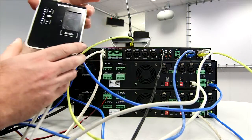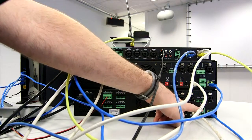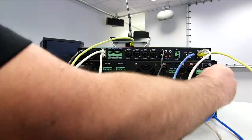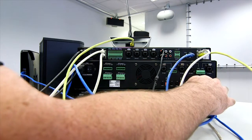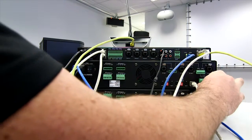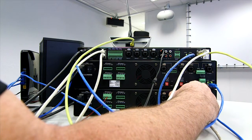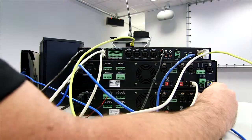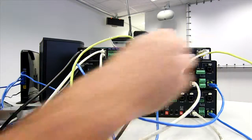The one thing I'll add is that the rear of the unit for the sensor for the auto standby mode is down at the bottom of the amplifiers. There is a 12-volt supply for movement sensors, and also a contact closure that can be accessed. The override input is below that, so you could actually put an EVAC or emergency override signal to the amplifier, or use it to pause the amplifier while the EVAC system is taking over. This is not an EVAC product — it's not EN54 certified — but the feature is still there for some countries and regions that require it.